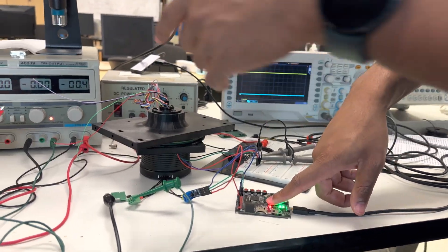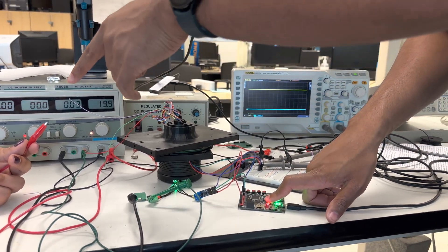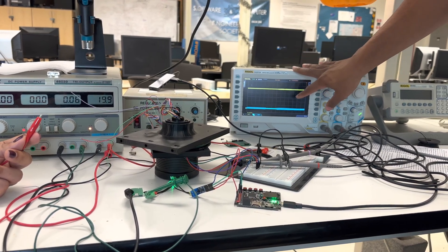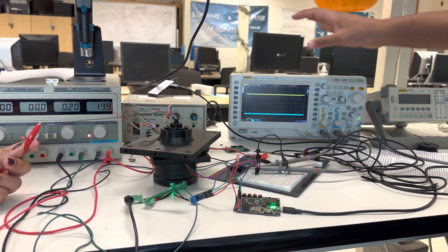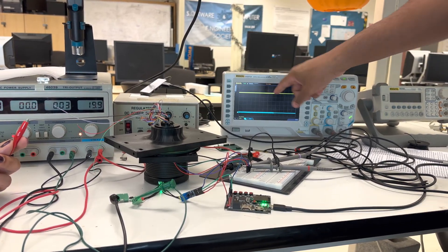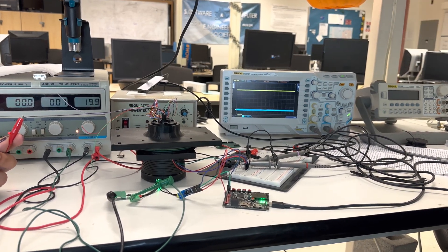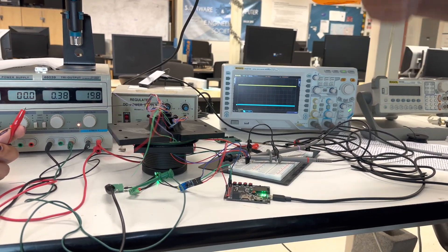Let me hold that and reset. Let's apply the power — right now we are connected to the black line. This is connected up to one of the lines right next to it on the slip ring. Now you'll see some fuzziness here — this fuzziness is actually interference from the servo itself, it has nothing to do with our slip ring in the middle. When you turn on the motor, you'll see the interference start. I have seen in prior experience that just turning on the motor will cause interference from the motor's circuitry trying to control the windings.